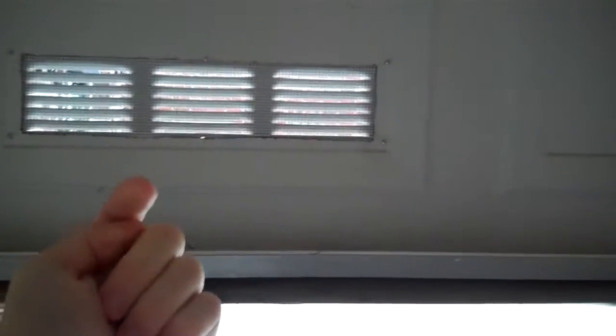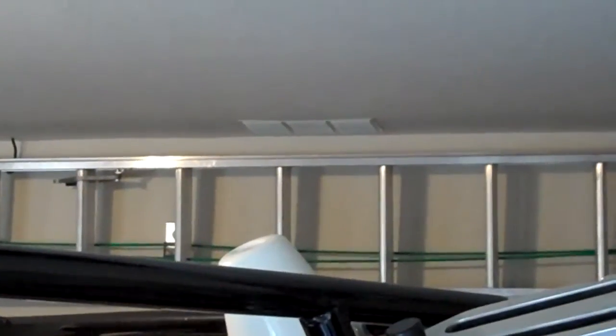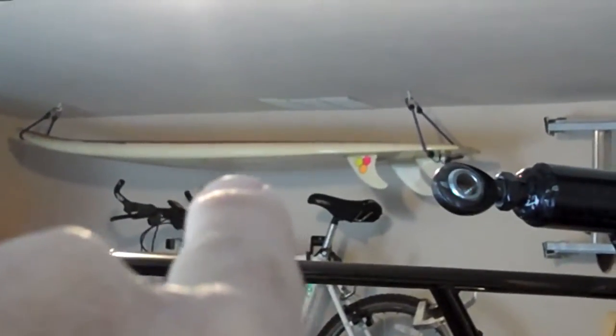There are the vents right there in the garage. Creates suction coming in the garage, goes up to the ceiling. You can see there are six by twelve soffit vents in the back. That allows the air to go in the garage, up into the ceiling, into the attic. And there's my third solar attic fan. It's getting pretty cloudy outside so it's starting to slow down.